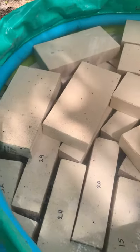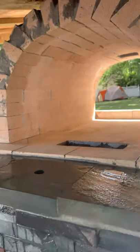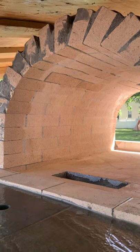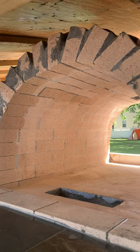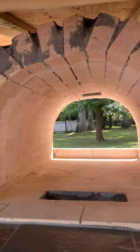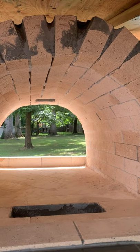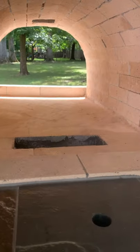I'll probably let the brick soak just a little bit longer - it won't hurt it. I numbered them so I can put them in the water and grab them in the order they're going to lay. When I cut the hole through the fire brick for the oven light, I did that before mortaring because I wanted to make sure the fire brick wasn't going to break. The last thing I wanted was to get this all together and then have the brick crack right down the middle when drilling - so I did that beforehand.